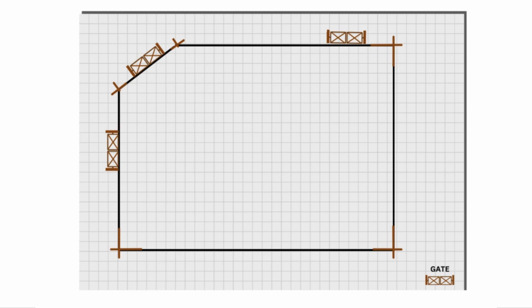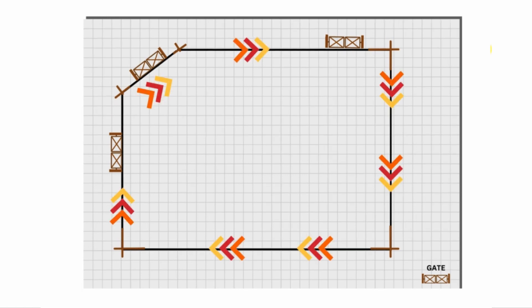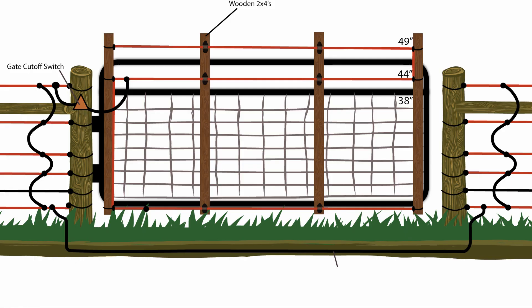Before starting to make connections, you'll have to decide whether you'll be setting your fence circuit up as a single line or a loop. A looped, closed circuit fence is more efficient at carrying voltage. Generally speaking, a fence set up in a line makes it easier to find faults and shorts. For this fence, we're connecting our hot wires in a loop to maintain the highest possible voltage.